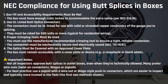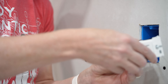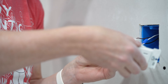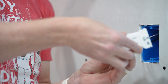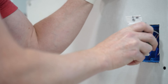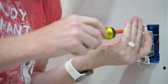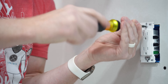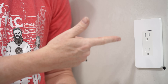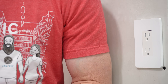With our wires properly extended I can wire up to my outlet — using the Leviton Decora Edge here — one, two, and three, and I just wired an outlet easy as pie. I'll do my Z-fold in here, got plenty of room now, then fasten it in, get my power turned on, and we're all set. Just like that we're wired up and we've got plenty of length on those wires — they're up to code, safe, and easy to work with.